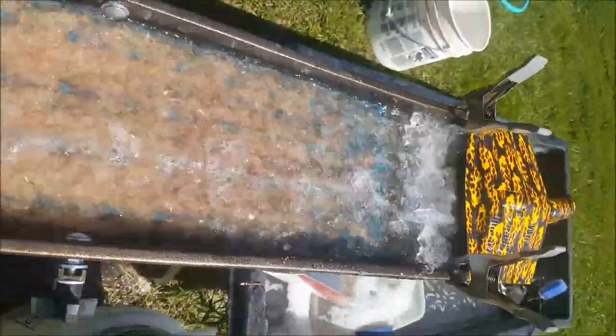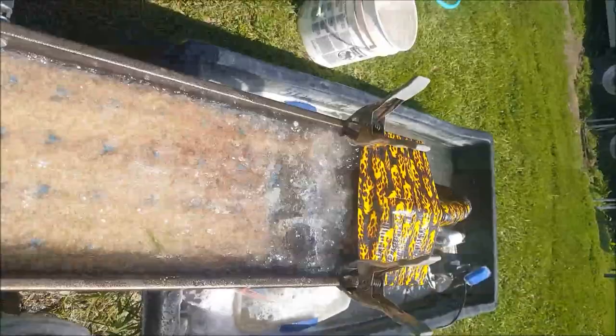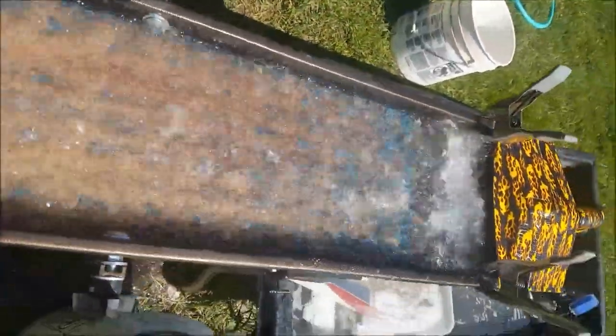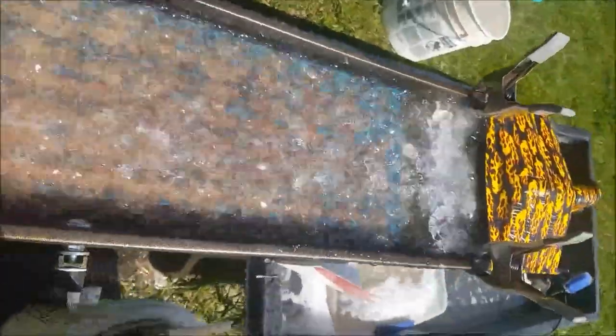As the heavy stuff is being introduced, that light material is just going to blow right off of there, and it's going to work itself out, and the heavy material through the active exchange is going to replenish into the cells, so you'll have the heaviest material in the cells, the heaviest black sands and gold, or in here, the garnet and tungsten. See how it's always getting redder? It's just pulling off that, it's just leaving the building. So here we got that light material just leaving the building, active exchange.